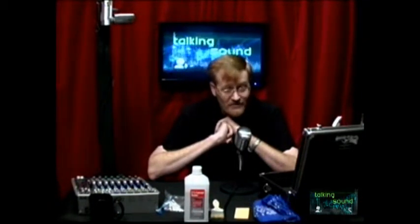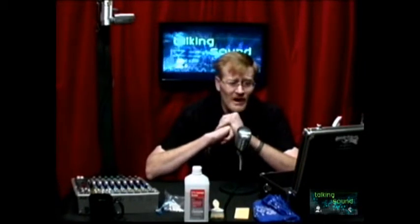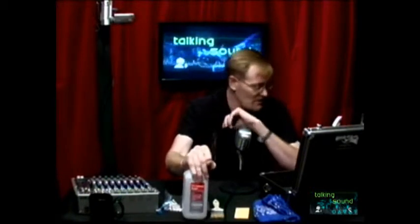Electronics and water, since about the late 1800s, have not really gotten along together, so we try to keep them as far apart as possible. Whenever you're cleaning, what you want is something with a fast evaporation rate — that's why we use rubbing alcohol; it evaporates rapidly. Your doctor's office or first aid kit will typically have the 70% solution, which is fine, but if you use it make sure to keep the equipment off for an extended period to let all the water evaporate. You're also putting water on metal, which means corrosion of contact points.